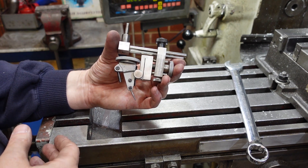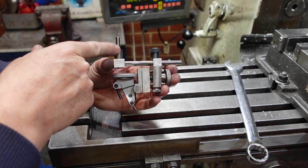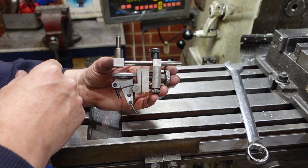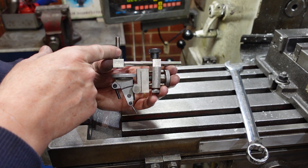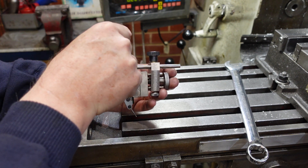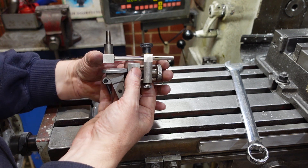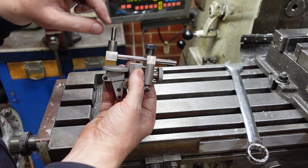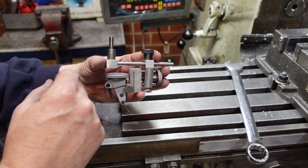So what are the good and bad bits about this? Well, the original design had a stepped shank here to grab onto. I took one of the steps out, but in reality that's not necessary because all my drill chucks are 12 millimeter or half inch, so I can have a 10 mil shank on there without any steps and that'll be fine. One of the things that would worry me about grabbing up the top there is that there's a possibility of some flex because it's a thinner section, so I think that could be changed.